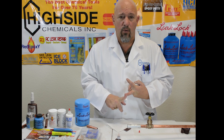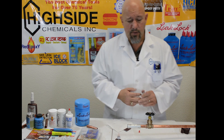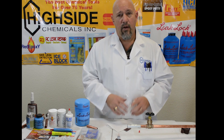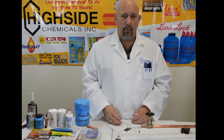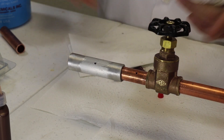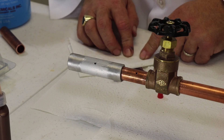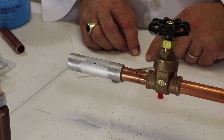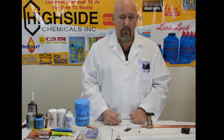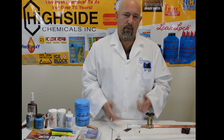If you don't like to solder, or if you have young apprentices working in the plumbing and HVAC industry, this is a great product for them to use. If you're doing copper or brass art, this is another way to do this without messing with solder. That bond is starting to take place — it's not totally cured right now; it'll take 20 minutes to get that 700 PSI bond. But right now the bond is complete enough to continue working and finish the job. By the time you get your torches out and find silver solder, you already have this bond made.